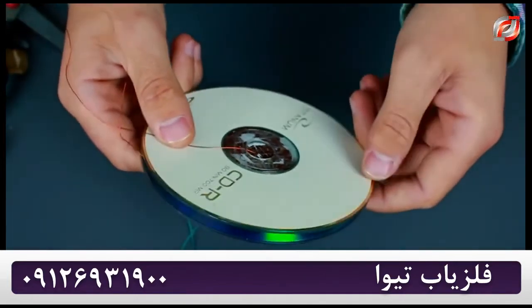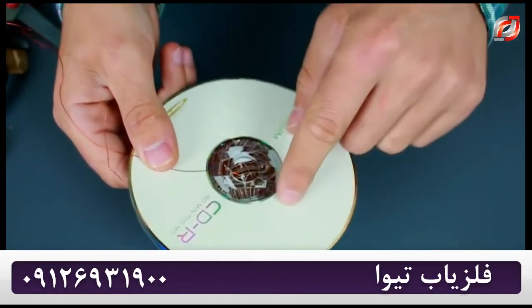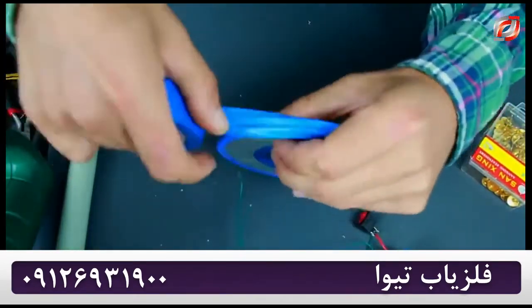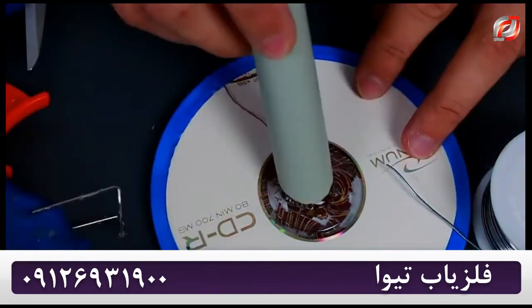Just use a 0.2mm thick copper wire — not going to talk about induction now. You also have to cut out a cardboard circle of the needed diameter. Generally speaking, all compact discs are mostly identical, so you're not likely to fail in making the coil. Now we just need to wire it up and make a case to fit it all into.